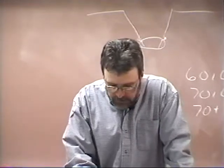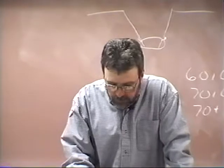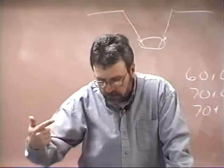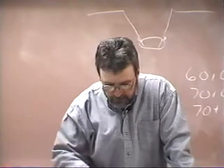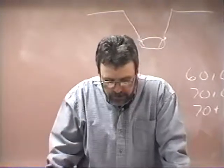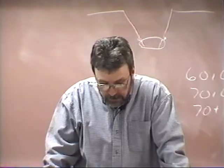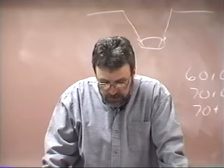And if you look at this, it says, method of breaking the arc by quickly flicking the electrode downward away from the crater. So you're coming down like so, you're forming your bead, you're ready to stop, and it's just boom, just flick it right out of there. And then in very bold print it says, this prevents slag from mixing with unsolidified weld metal, creating a slag inclusion. It says remove slag from the crater and 2 inches of the bead.